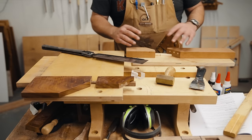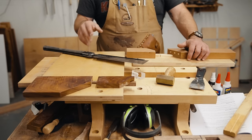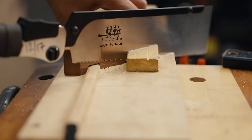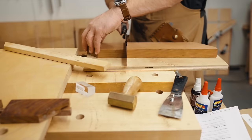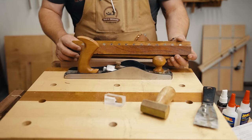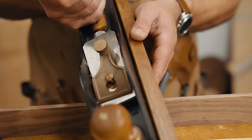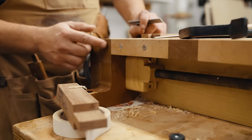One of my favorite uses for magnets is shop jigs. Here are a couple of cutting guides I made that have been great for using a handsaw and getting great cuts. This one is also a shooting board — it's actually like the third video I ever put out on YouTube. It's got two cutting guides: a 45-degree with magnets so you can just pop your saw in there and get a perfect cut, and you can flip it around to encapsulate the saw if you want. You get perfect 90 and 45 degree cuts. I also made something years ago that helps keep your hand plane square — it hooks right onto your hand plane and gives you a 90-degree fence.